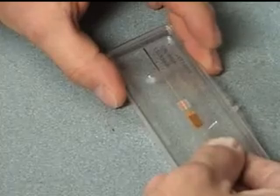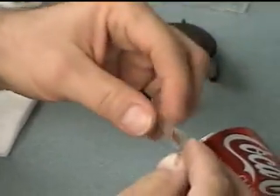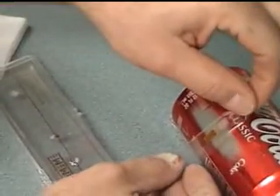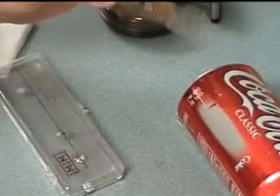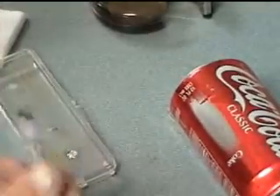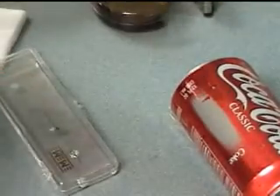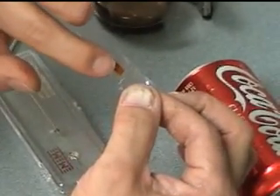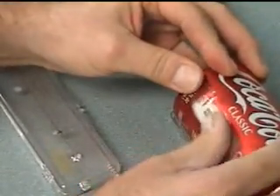Pull the tape off at an oblique angle like this, and we've got a position — a situation that's easy to work with. Since we've got it oriented this way, we'll go like this. You can put marks on the surface, but put the marks out further because if you put them too close, you'll clean the marks off. The center of the gauge is the center of those little accordion-type wires. We'll put the gauge right there and stick it down.